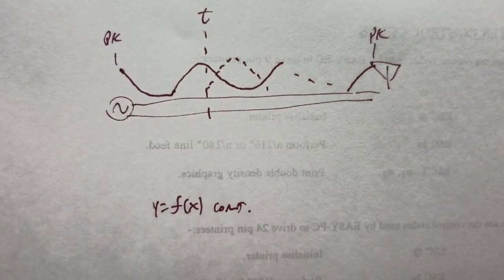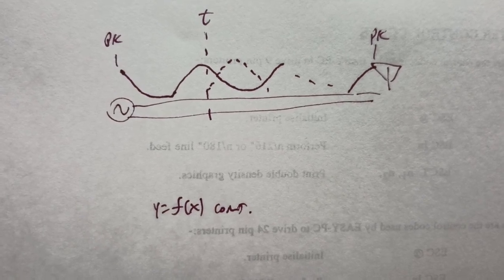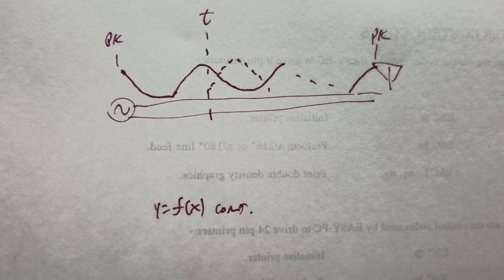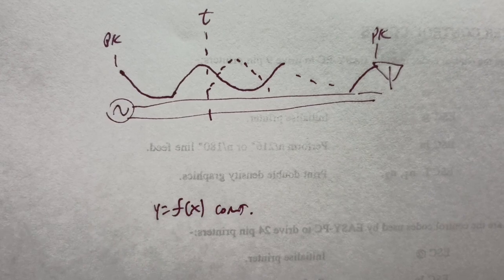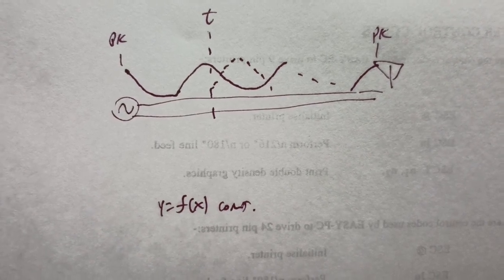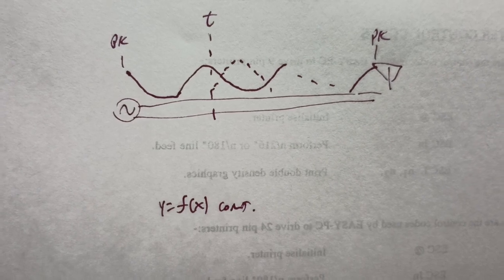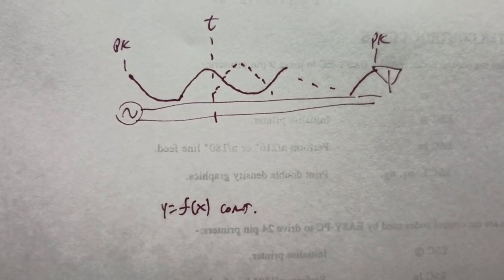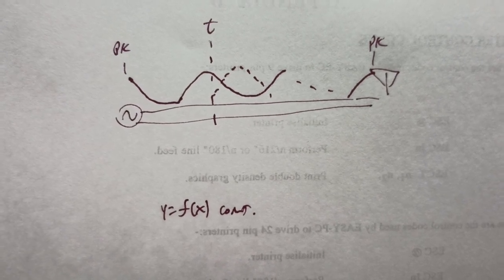So what indicates a correct match at the feed point is zero indication. Key the transmitter, and the meter doesn't move. The indication is not that it moves a little bit and we just say that's okay, because it isn't. My experiments here show that a little mismatch is a very bad thing. No, it doesn't result in a tremendous loss of energy transfer to the antenna, but it can change directionality. And there's the key.